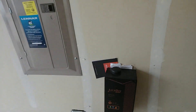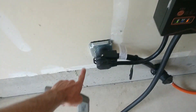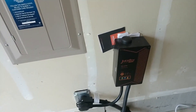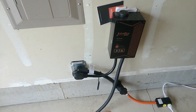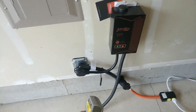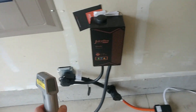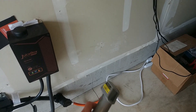I called up Grover Electric Supply the other day trying to find a splitter for a NEMA 14-50 to 14-50, and the person on the phone immediately said we do not sell this part — it is not recommended. But yet I'm pulling 3.3 kilowatts from the Juice Box. This is a 50-amp circuit and I'm pulling two 12-amp 120-volt power draw circuits here.